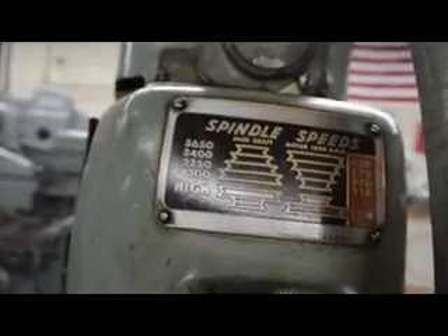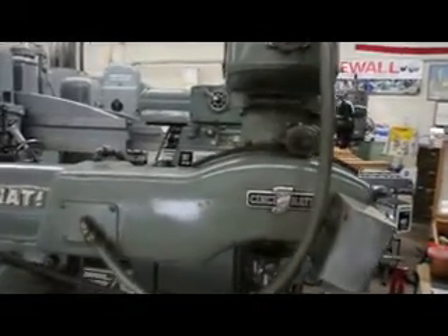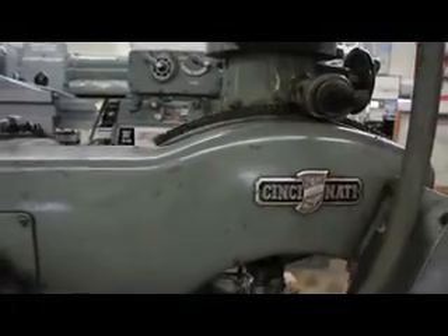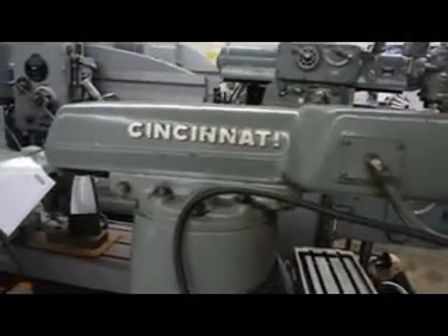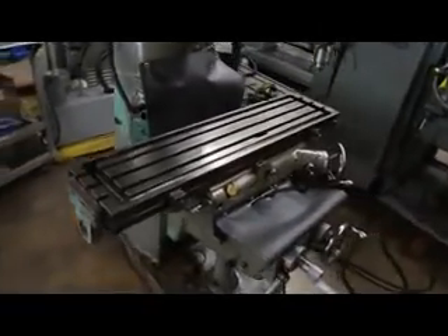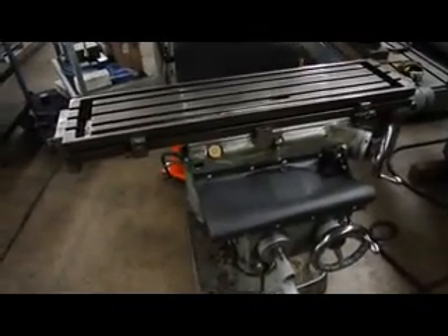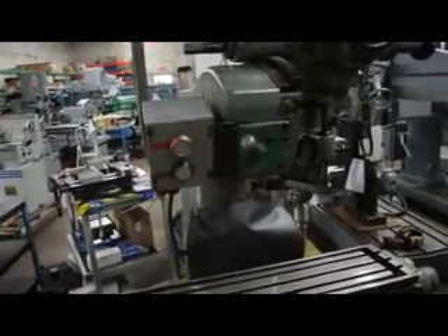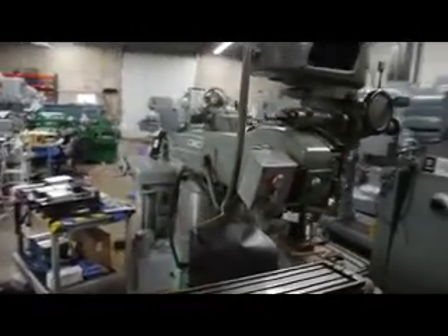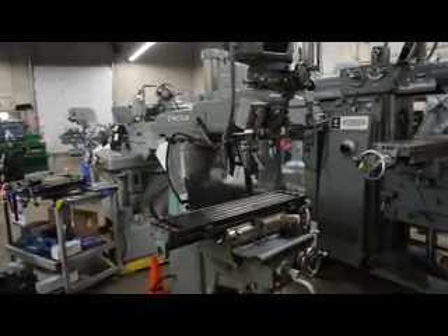To verify: 215 on the lower right, 5,600 on the top left. The machine has a newer belt in it — it runs quiet and runs smooth. There are some really cool tags on this machine too, which we'll show you. The condition of the 10-inch by 42-inch table is still in pretty decent shape, and the ways are nice.